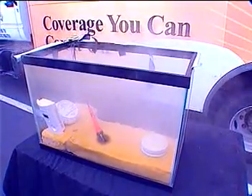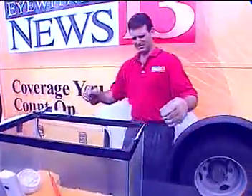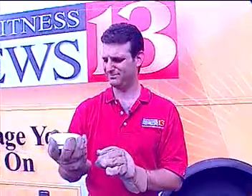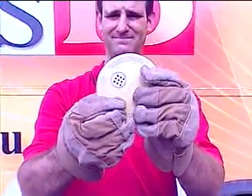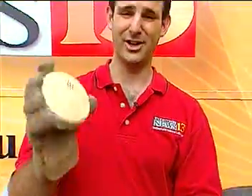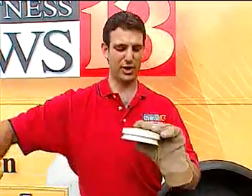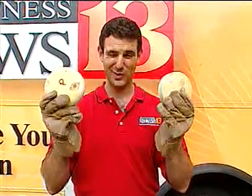So we decide to end the test. I take the aquarium outside to take off the lid and get rid of all that toxic smoke. We can still hear the photoelectric smoke alarm. But what about that brand new ionization smoke detector that did not work while it was surrounded by smoke? Once all the smoke is gone, I check it out one more time to make sure the battery inside the alarm is still working. You can hear it does have a working battery — it should be a working smoke detector. And yet 30 minutes, this didn't go off. Within five seconds, this did. Which one do you want in your home?